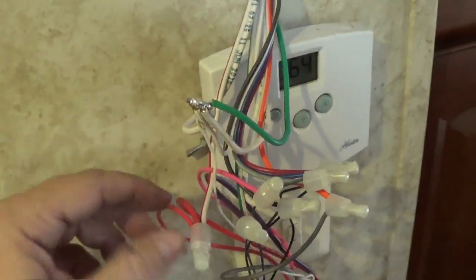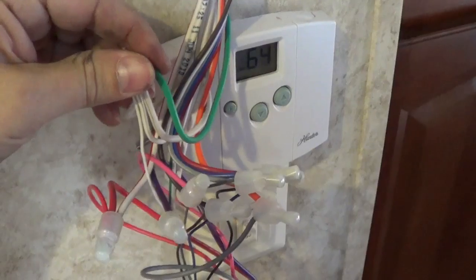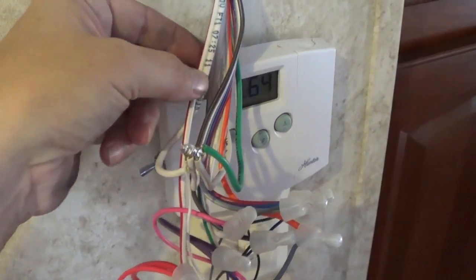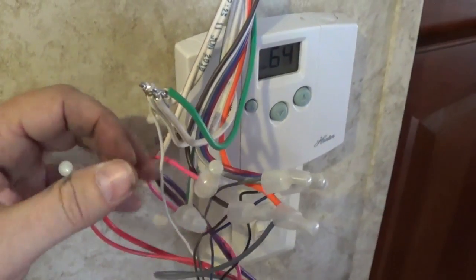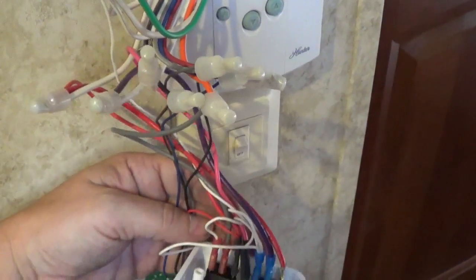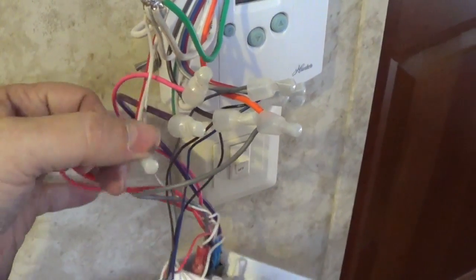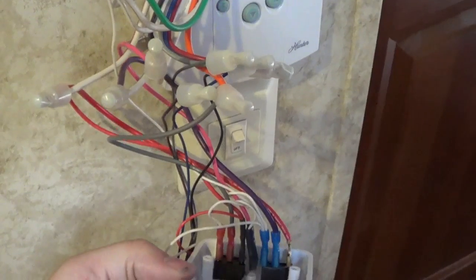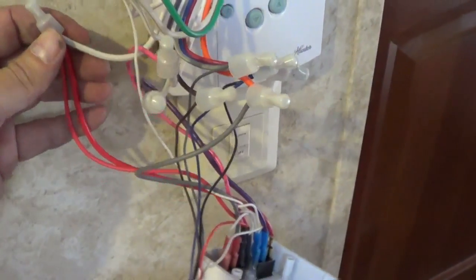I'm going to divide and conquer this. I took off the butt connector and put all the ground wires together with a nice solder joint. This appears to be the main power coming in — that's the type of wire they use for a main 12-volt circuit feed; I've seen it on the lights. Now that I know I have my power and ground, the new control panel won't need a lot of this old wiring. I just need to figure out the pump output, the heater output, the heater light output, and then the sensor wires. For the solder connections, I make a hook on each wire so it has a mechanical connection that won't pull apart, then bathe it all in solder for a really good connection, and finish with heat shrink tubing.